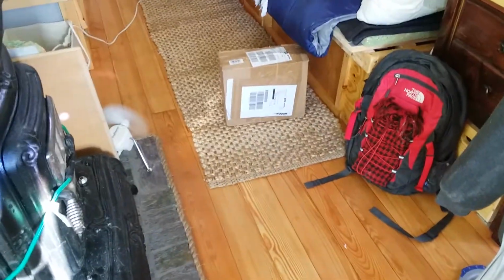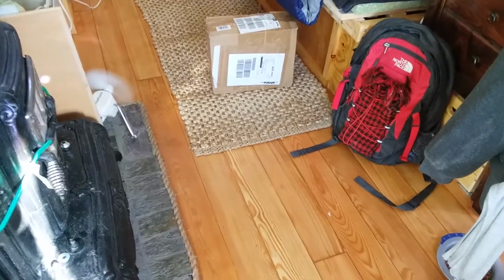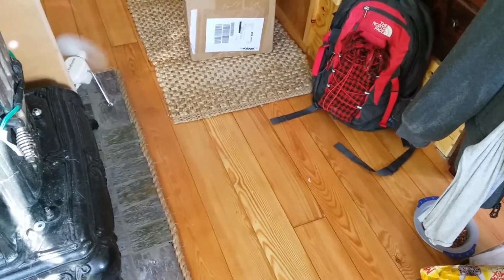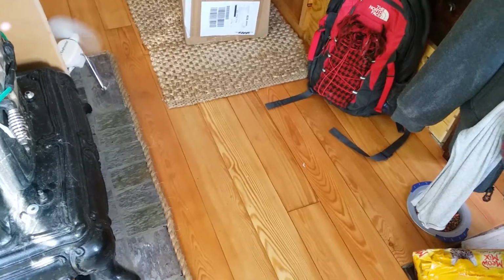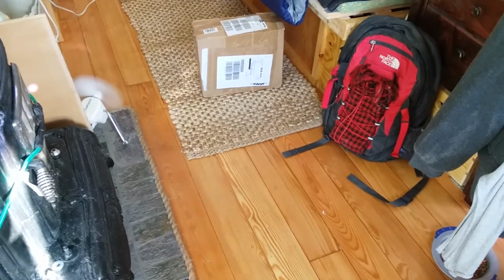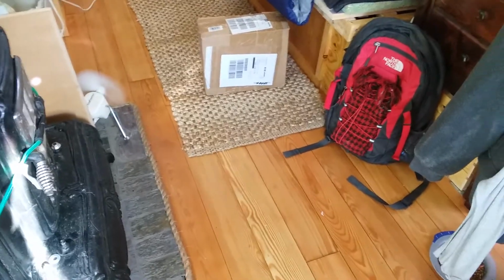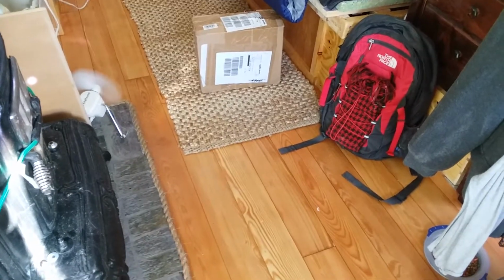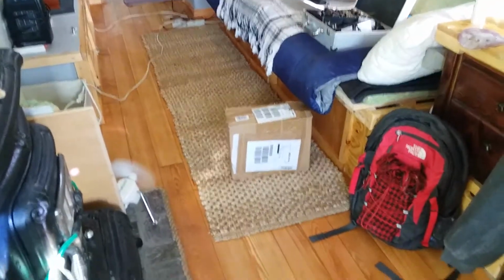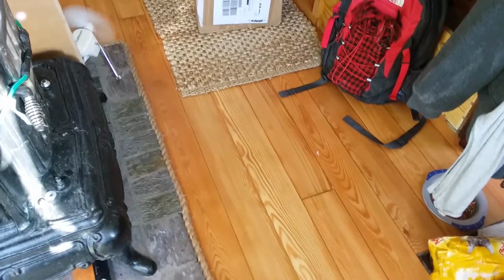You guys already know, if you've dealt with polyurethane or urethane finishes, that if you get a scratch on it, you can't just polyurethane over it. It'll leave a gully in there. It's the same exact way as working with a scratch on a car. It has to be fully sanded out, and the whole panel has to be painted and blended into the surrounding areas in order for the floor to look uniform again. Oil is not like that.